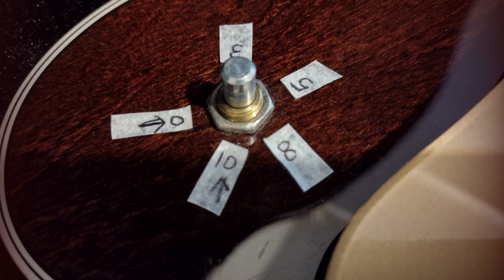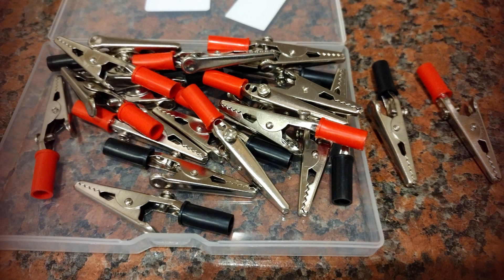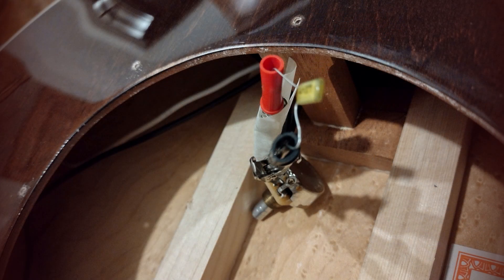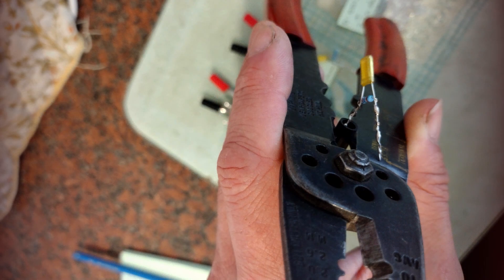What I've done in the demonstration is to start the volume at 10 and then attenuate the volume downwards. I'm going to be kind of guessing because the master volume pot is actually in the back of the guitar, so I can't really attenuate it the way I would normally when it's fitted. The reason I've done that is because I'm using crocodile clips on the capacitors and resistor combinations — so the installation of the treble bleed circuit is temporary. At a later date I will solder the circuit into the guitar permanently, but this is an easy way of swapping out different combinations.